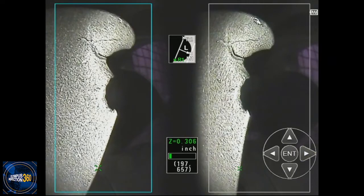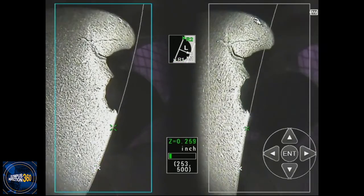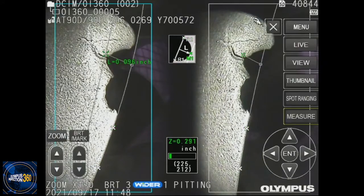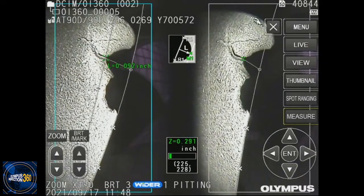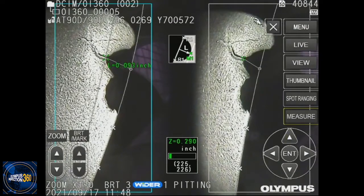This is pretty straightforward for those who know. I'm picking two points, and those two points I will use as my reference line, and I will measure off of that reference line. I can then come in and measure some of the missing material. You may notice that there is a crack to the left of this missing material. The main point is the relevance and effectiveness of using 3D modeling to show you what it is that you are measuring. This is how stereo measurement was traditionally done in the past.